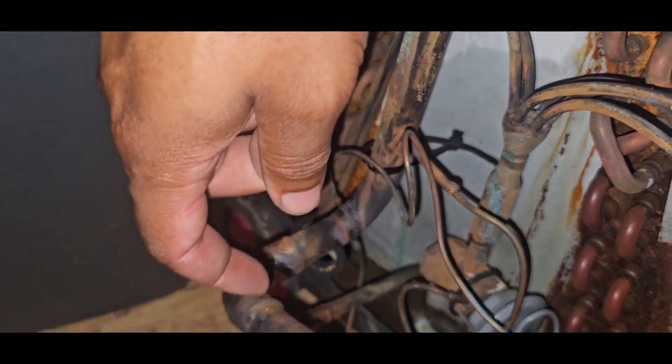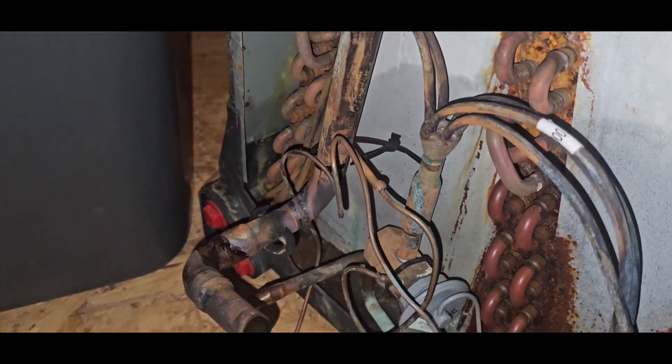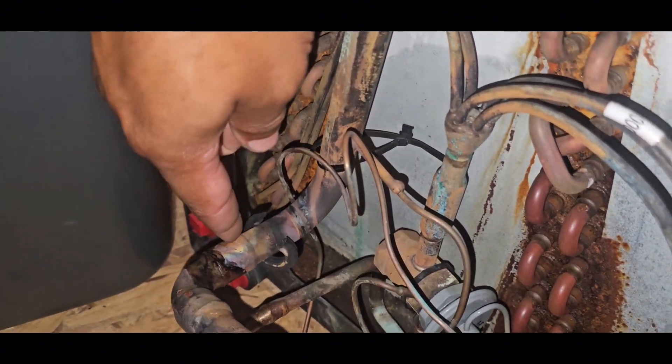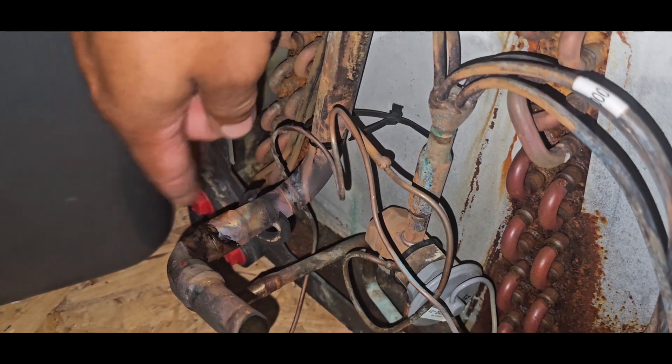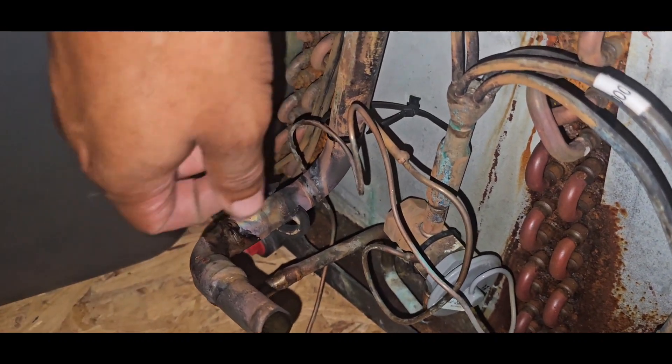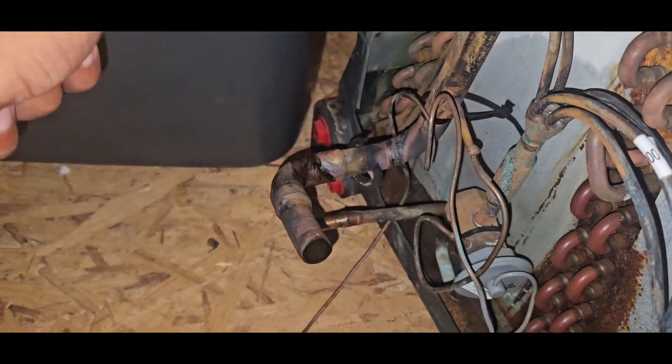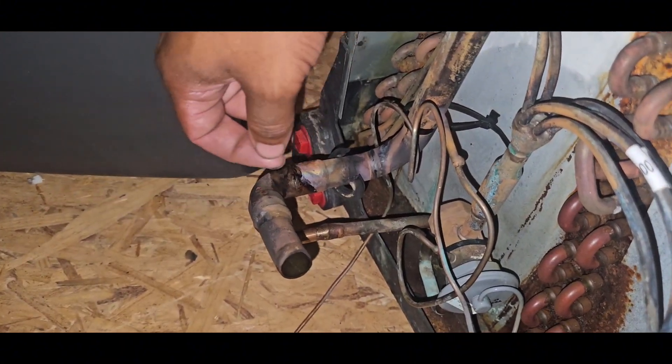Got the old coil out, but I ended up having to cut it off. Even though when we got here there was like one-point-something PSI of vapor left in the system, there was a good amount of vapor trapped in here. I was trying to braze it off but it just kept lighting and igniting and we couldn't ever get the joint to fully pop off, so I just cut it out so we could get the coil out of here.